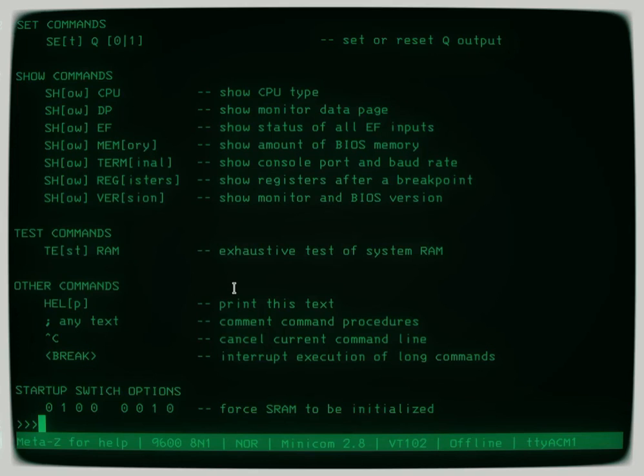So anyway, it's pretty cool for a couple of dollars worth of Blackpill board, nothing hooked up to it outside of a USB-C cable, and you've basically got a nice 32K RAM, 32K ROM, COSMAC ELF with all the fixins, serial port, and no disk drive, not yet anyway.